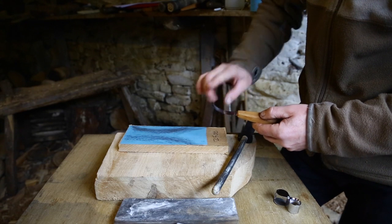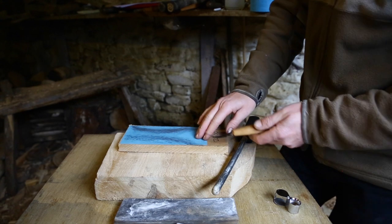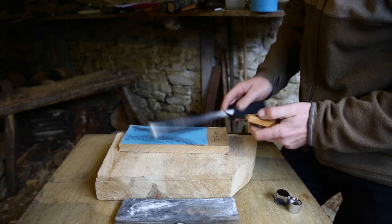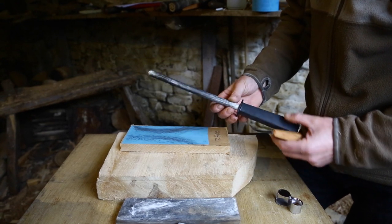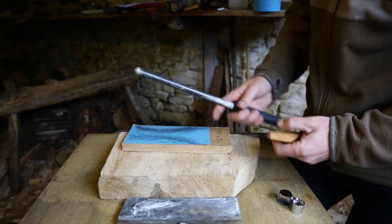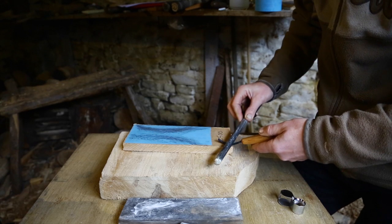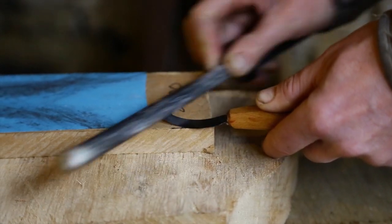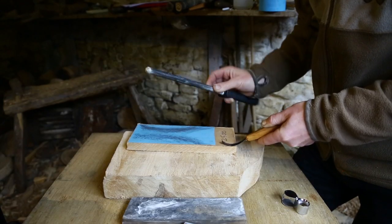What I'm going to do next is take the burr off on the inside. Some people use emery paper wrapped around a dowel — I would advise not to do that. I use something much finer: a ceramic sharpening knife sharpener which you can buy from IKEA for £10. It's very very fine and does the job incredibly well. I'm going to rest that flat on the inside of the bevel and just move it a little bit backwards and forwards to give it a polish on the inside. That's all it needs.